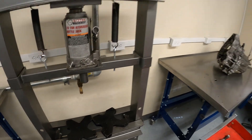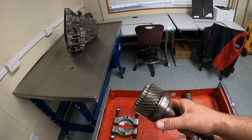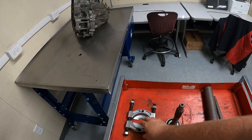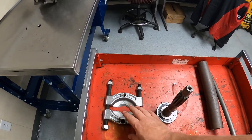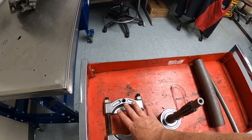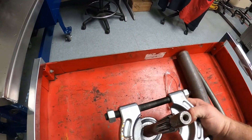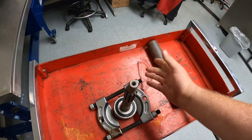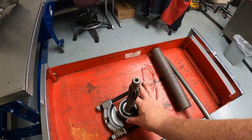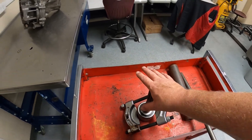As a demo, I'm going to use an input shaft with a ball bearing on it and we're going to separate the ball bearing from the input shaft. To do that we're going to use a bearing splitter - a tool where you unthread the rods, expand out the two blades, put them over the piece of work, tighten the jam nuts, which will grip the base of this bearing and pull it off of the input shaft when we apply force to the top.